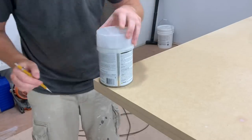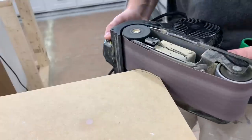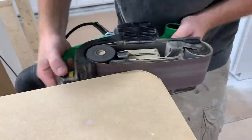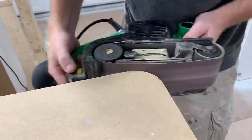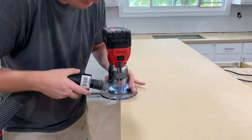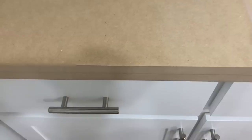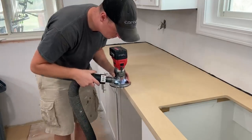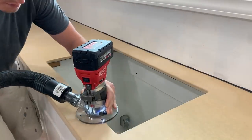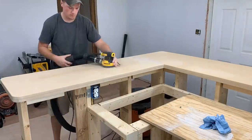To save a lot of damage to people's hips, I used the Bondo can to trace and cut out all the outer corners on the island. Once that was done, I used the router to put a slight roundover on all the edges. I knew I wouldn't be able to get my router tight to the wall in a couple spots, so I made sure I got those rounded over before installing. Lastly, I could get everything sanded smooth with 220 grit.